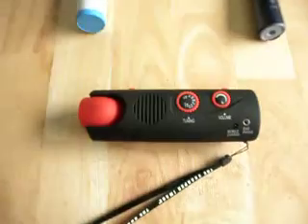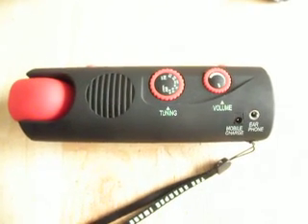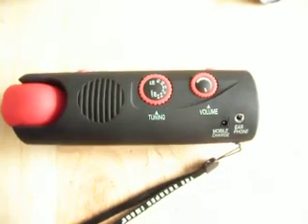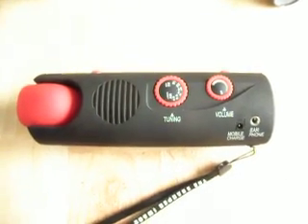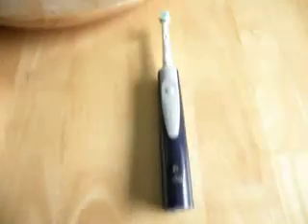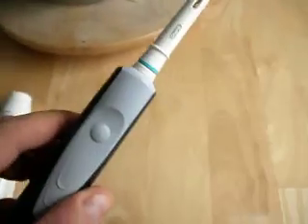So we're going to test the EMI of these electric toothbrushes with a standard AM radio, which we're now going to switch on. It's tuned to the AM band at 530, where there are no radio stations. I'm going to start with the conventional toothbrush and we're going to see what fields come out of this.